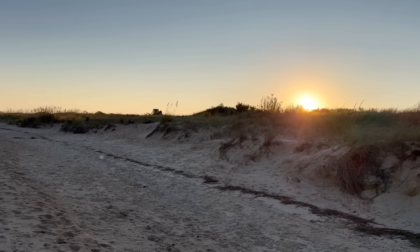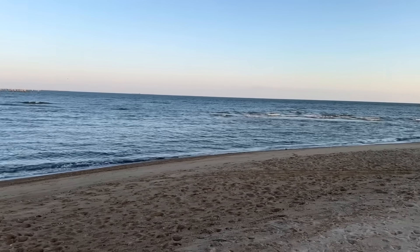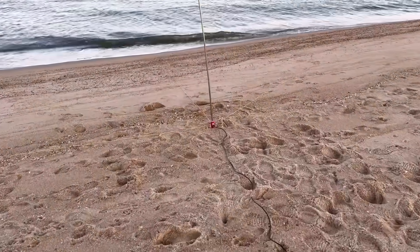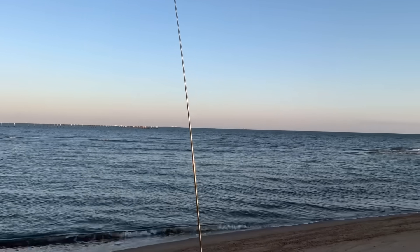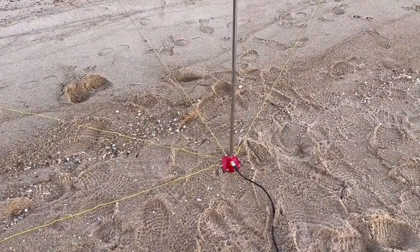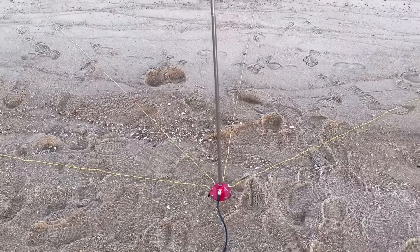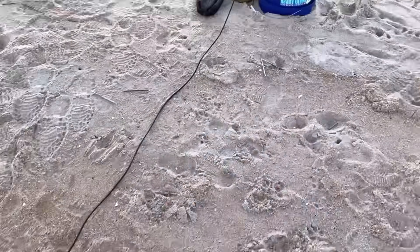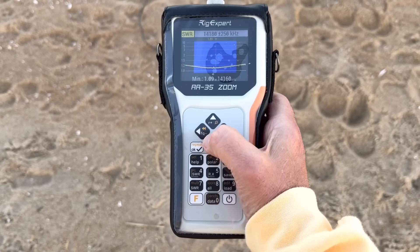Here's the setup as the sun rises over the Atlantic to the east — technically this is the mouth of the Chesapeake Bay area. For the antenna, I've got about five meters of coax. It's a telescopic whip, very simple, tuned down for the 20-meter band. I'm using the JPC-12 radial plate with four radials, all pointing toward the water. I tuned the antenna with my RigExpert AA-35. No choke, so the coax going back gives me a bit of 360.